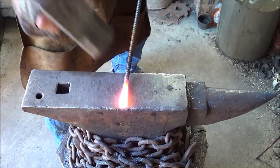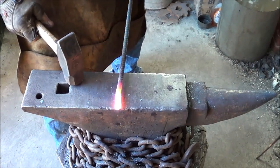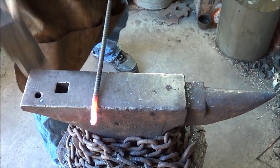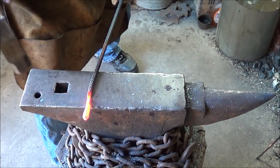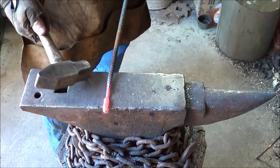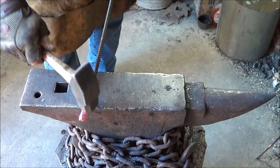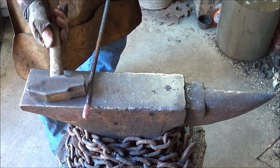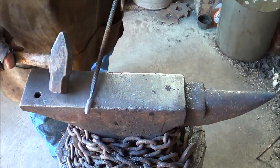What I like to do is approach this like I would a leaf. With a leaf I put a taper on to make a point — I want it to be a smaller diameter out here anyway, so I'll put a little bit of a taper there. I'll choose what steel I think I need for the ball, and taper that back to the size I want the handle to be when I'm done. That looks nothing like a ball and I really wish it was — totally round is what we're after. I haven't figured it out yet, but I will. It might just mean you've got to work harder to get what you want.